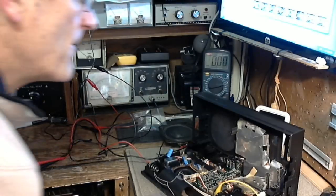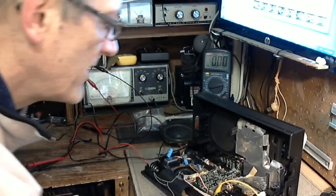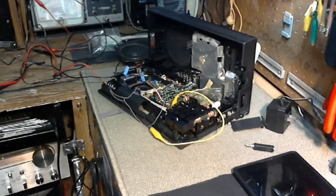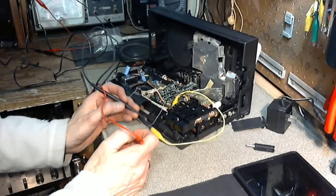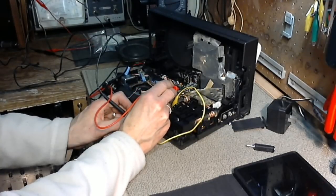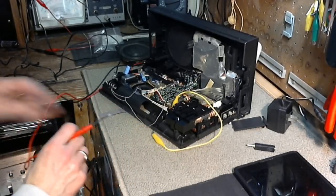Now why isn't it hissing like crazy, like it has before? And what do we got? Oh, we got nothing at all on the screen. Okay, that's suggesting we don't have any battery power from the 3 volts here. We don't need to look at that power supply anymore. I'll keep an eye on it. Now, let's see if the 3 volts shows up in the radio. Maybe I've got something not quite right here. Yeah, looks like no 3 volts. How come?